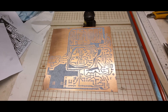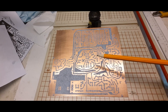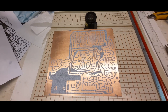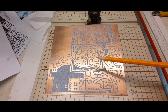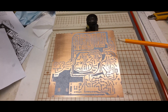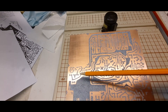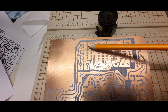The toner transfer process is completed. When I was putting it through the laminator, the center part didn't seem like it was adhering to the board, so I got an iron out and ironed the center portion more. This is a big board — about 190mm by 165mm. This blank spot is where the transformer will go, and this section here is for the diodes and rectifier.